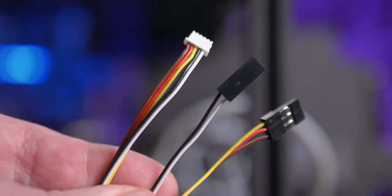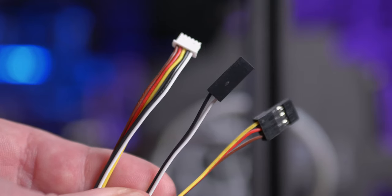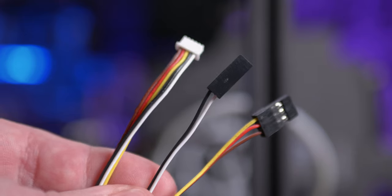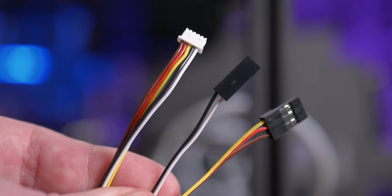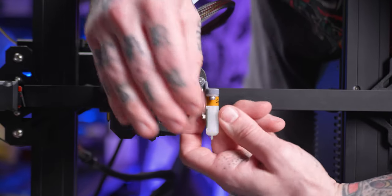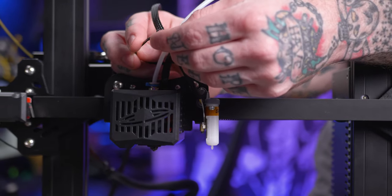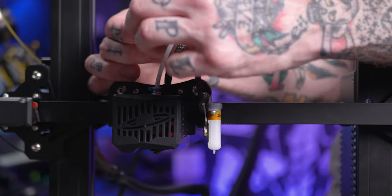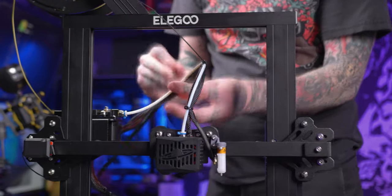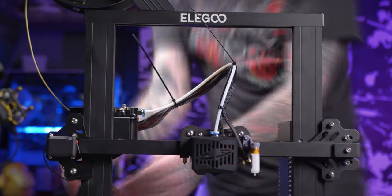For the wiring we need for this specific application, we need the five-wire harness that has the brown, yellow, red, black, and white wires on it. I went ahead and sleeved nylon braiding over the sensor wires for my build, but you don't have to do this — it just gave it a cleaner aesthetic, and the Elegoo Neptune 2 is a pretty clean looking machine, so I liked that. Just route your wires along with the Bowden tube past the extruder drive assembly, zip tie them together, and you're good.